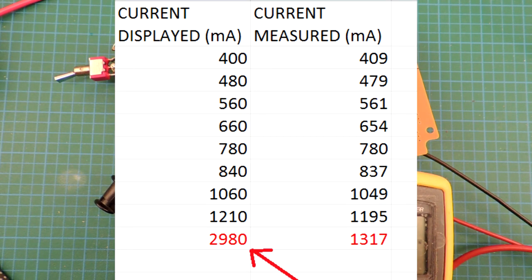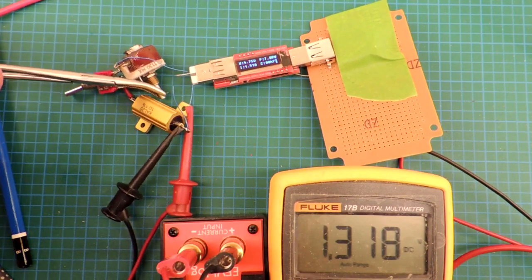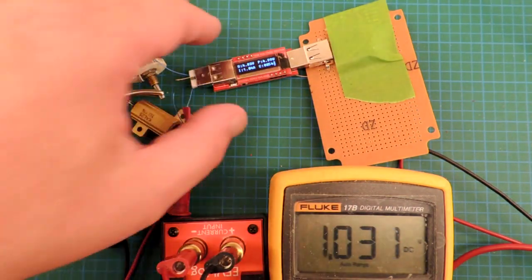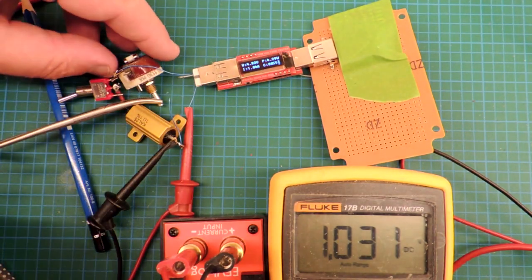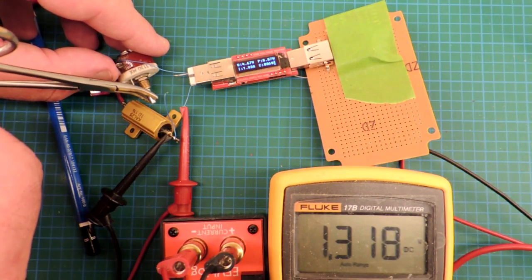Let me just insert a little table. Basically, this tester is really bang-on accurate until about 1.25 amps, and then once you go a bit beyond that, it seems to get into a mode where it starts to declare the current to be quite a bit higher than what is actually being delivered. I don't know if that's a fundamental limitation or not, but if we crank it back down to 1 amp, now it's 1.03 amps and the tester says 1.04 amps. So the tester basically seems to be really quite accurate and matching the results until about 1.3 amps.